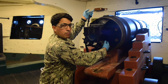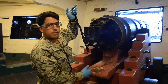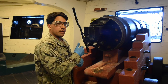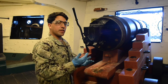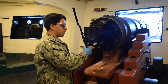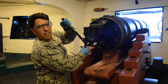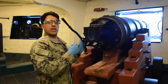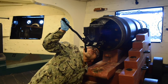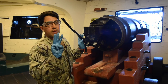Use our extractor lever, flick that towards us, and bring the charging handle towards us. It's now stopped on the lever stop, which is good — that's another function of the gun. Since the lever stop, or safety, is engaged, it's working. Remove that safety — move the lever stop to the side — and pull it down towards us to fire the gun. We're checking for the firing pin to be protruding on the front of the bolt face. Look underneath and verify the firing pin is there. You do this a total of three times.